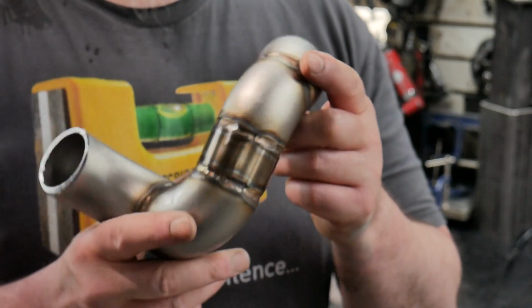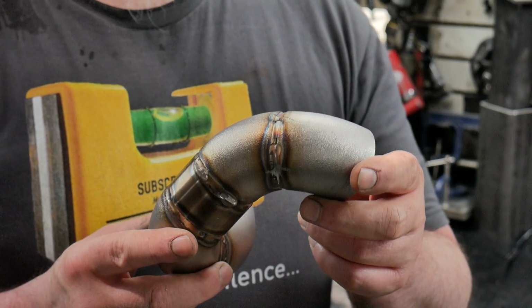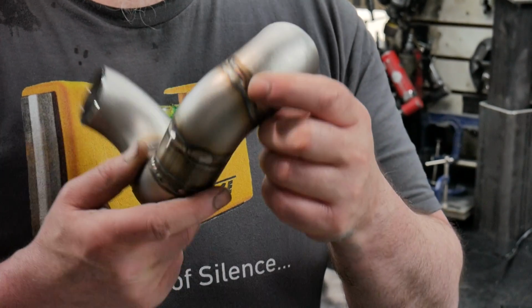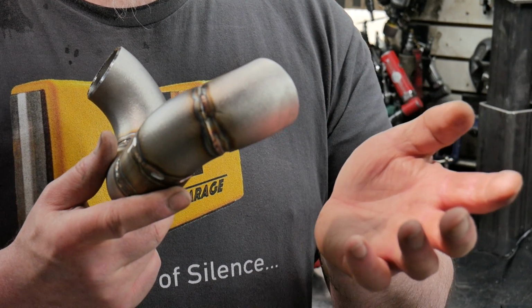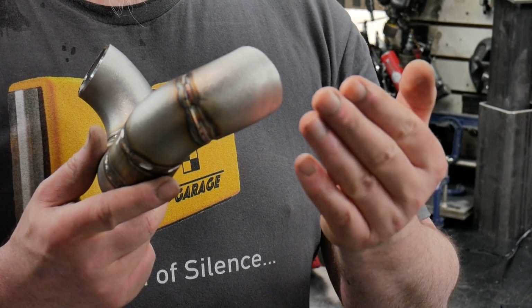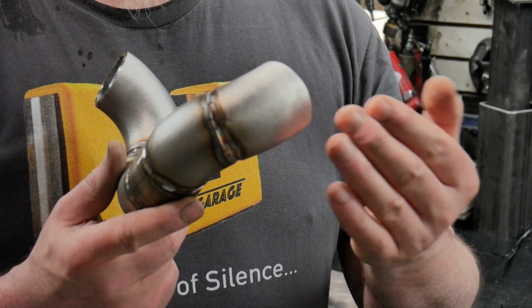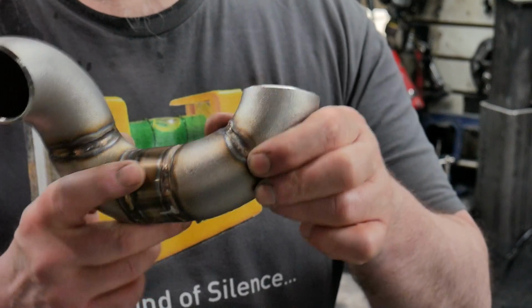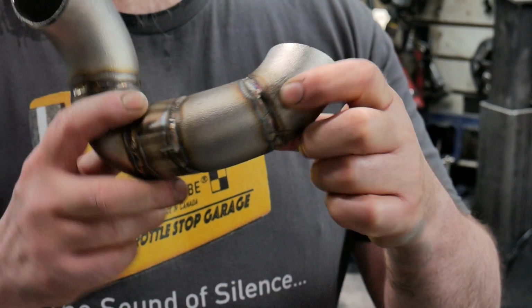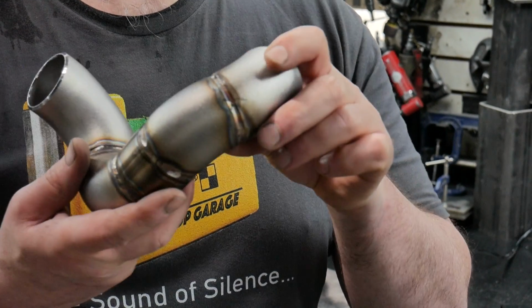Lessons that I learned along the way as I was doing the root. This was one of the ones that caused me a little bit of trouble. It sure is a whole lot nicer if you feather off right at the end as you're coming forward, just to try to avoid any little craters at the end, but you're going to get them. We're going to get little craters here and there. As long as they're not too bad, I'm not worried about them.